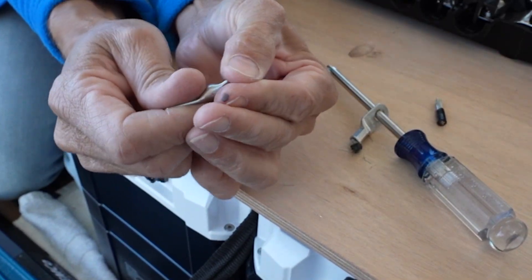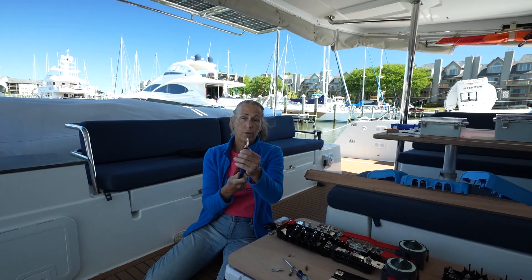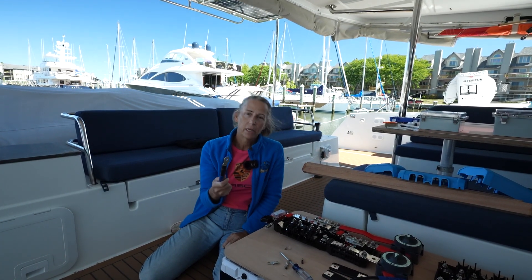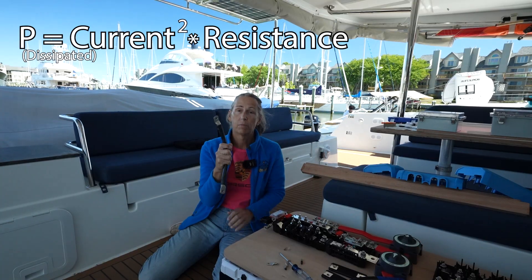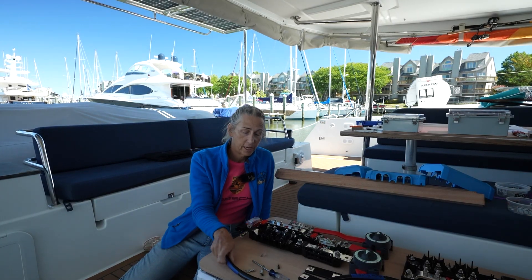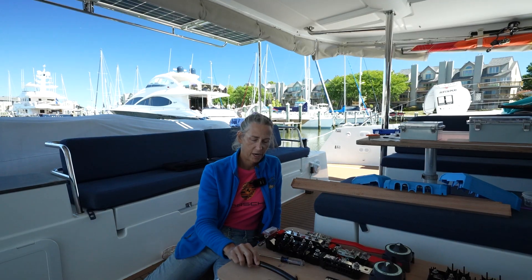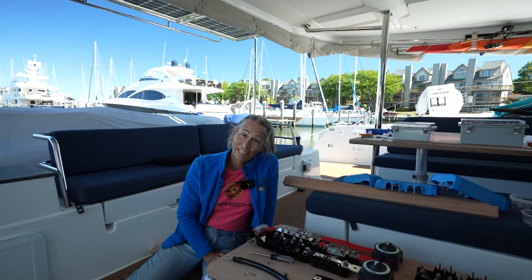There's no way we're getting that wire out of the pin-driver crimp. There's potentially 400 amps flowing through these cables. If your crimp isn't top-notch, it's going to get very warm because a bad connection creates resistance, and heat dissipated is I²R. So if there's more resistance, multiply that times the current squared — that's going to be a lot of heat at 400 amps. Be very careful with your crimps. Put a screwdriver through them and try to pull them out with everything you've got. If it doesn't budge at all, you're in good shape. I'm learning things as I go for sure.